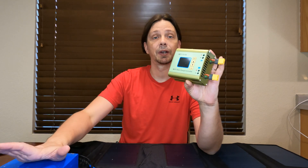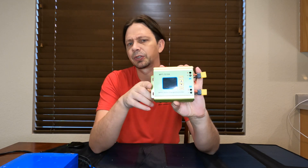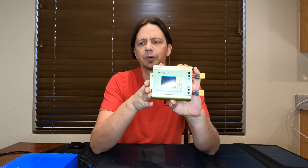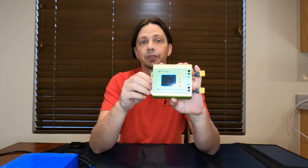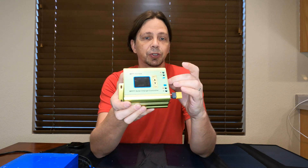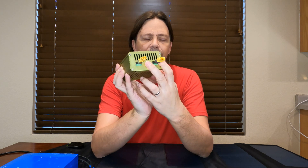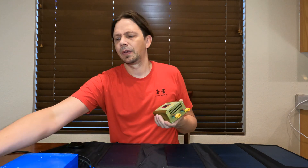Also in the description is the battery if you need one — it's a good 20-amp battery. This controller basically allows you to take just about any lower voltage, anywhere up to around 16 volts, and boost it upward — in my case up to 54.6 volts. I added XT60 connections into the side of it; they basically screw into the terminals. Later on I may solder in some direct XT60 ports.